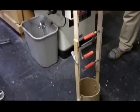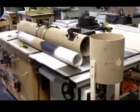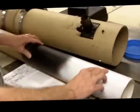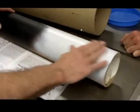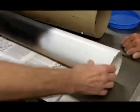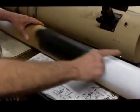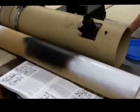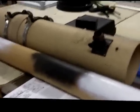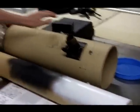No calculations needed — it either comes to focus or it doesn't. There's a certain amount of travel from the absolute minimum of the focuser. The tube gets two coats of Helmsman, which is a clear sealer — very thick, very easy to work with, and it works well with cardboard. Then two coats of Helmsman with a coat of flat black, and finally a coat of white spray lacquer. That's what goes on this tube, and it looks really good.